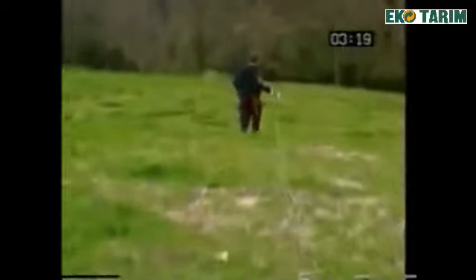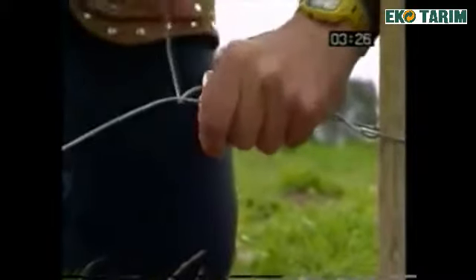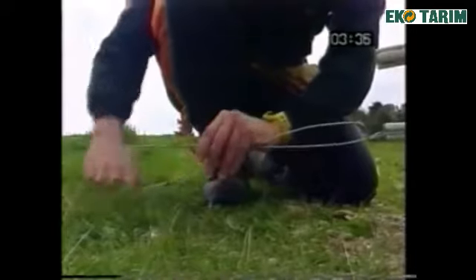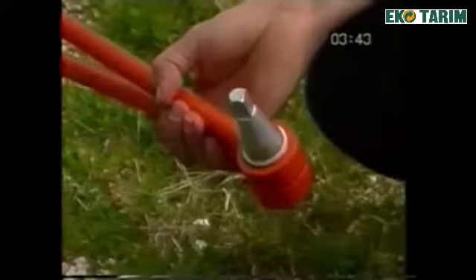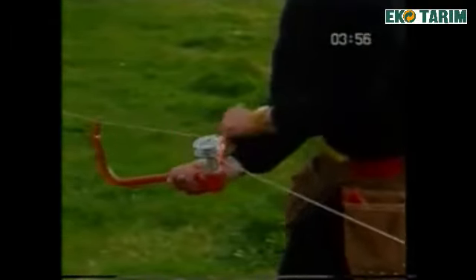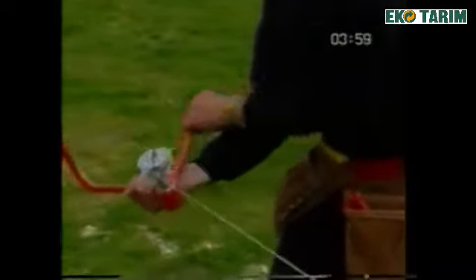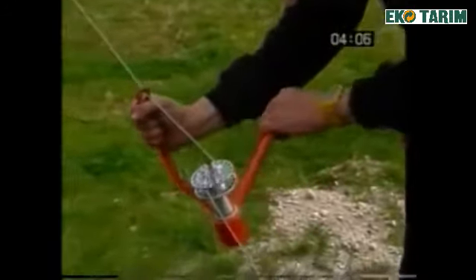Now you can run out the first guide wire. Tie off at each end, again ensuring that the strain is from the centre of the insulator. Here it is important to leave a long tail which is required later in the fence construction. Repeat this procedure for the second guide wire. Using the Gallagher permanent wire tightener and rapid handle, tension the wires taking care that they are not over strained and insert the locking clip.